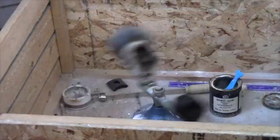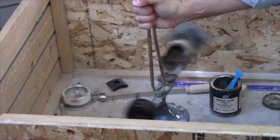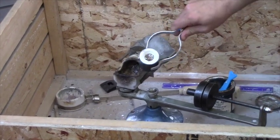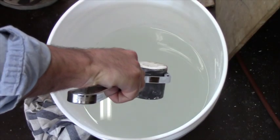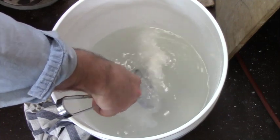The centrifuge makes it easy to accurately throw the metal into the mold, and the spinning keeps it in place while the metal is molten. Now that it has spun for a couple of minutes, I am going to slow it down and remove the flask so that we can see the button — the only part you can see right now of the casting. That is the button on the end of the flask, and it is very hot right now. I am going to place it in a dark place so you can see the color — that is how hot the metal is right now. We do not want to quench the mold while it is this hot; we want to let it go down below red heat before we quench it. Now we are going to quench it in water, which will remove the plaster and release the metal models from this mold. The investment mold is destroyed every time you do a casting.